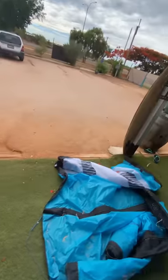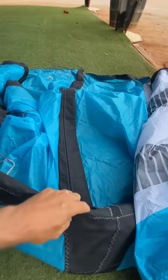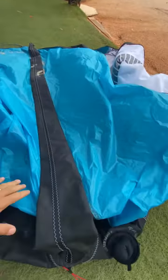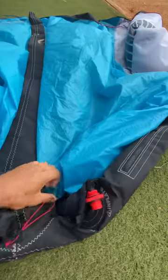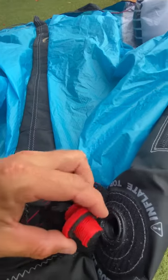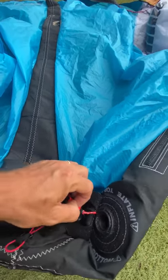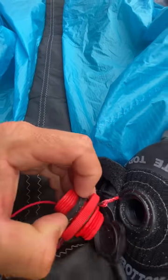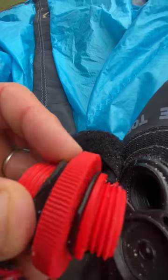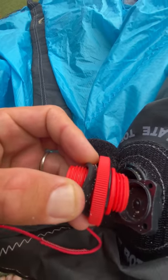Okay, I'm going to try my best with my phone to show you exactly what I mean here and how we can prevent that from happening. So let's have a quick look underneath this cap. Here is my Boston valve and you can see it screws in there. Now if you were to lift up this o-ring — getting nice and close so you can see — you can see all that sand that just sits behind that o-ring there. That's definitely enough sand in there to cause that to leak.